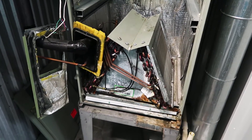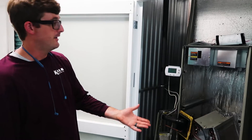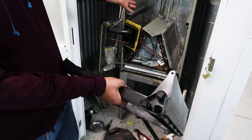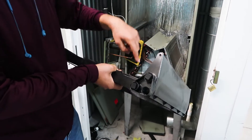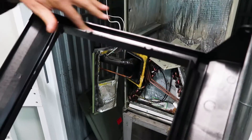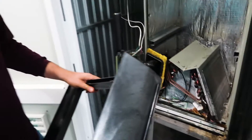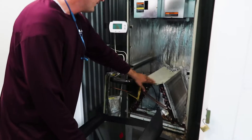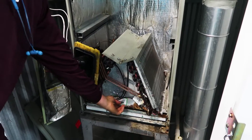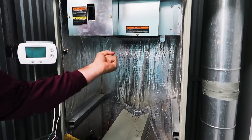Most people don't think of this too — when you've got a filthy drain pan, most guys are like, oh, we've got to pull the coil to clean the drain pan. Well, what I've done in a lot of cases is pull the blower, pull these panels off like you see. Take the screws out of the front, maybe the ones out of the back, and you can usually get some clear tubing under there with a vacuum and clean under it. Then you can lean over where the blower was and get the back section too.